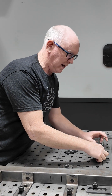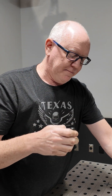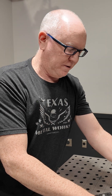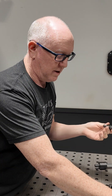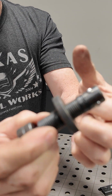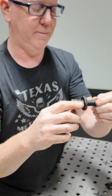There are actually three different ones that we stock. For a standard table using one-quarter-inch thick plate on top and attaching a one-quarter-inch thick piece, you need a one-half-inch deep ball lock. If you had a three-eighths-inch top, then you need the five-eighths ball lock. If you're doing something with a half-inch thick top or other configurations, we've got one that is fully height-adjustable — it can go from pretty small up to over one inch thick of stuff being clamped together.